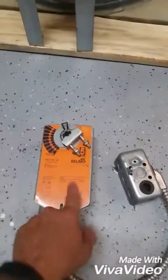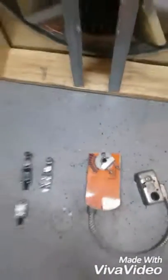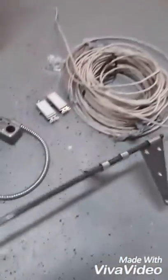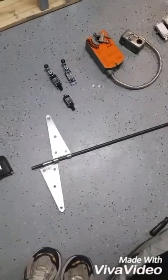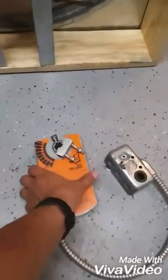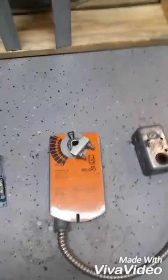What this does is when power is applied to it, it'll turn a screw. What I have here are hinges that I've pre-made — by taking a half-inch rod and two hinges, knocked the center out of the hinges and then widened it so it'll fit on the half-inch rod. This rod end right here will go inside this hole right here, so this will actually turn that rod and open basically the damper for the whole house fan.